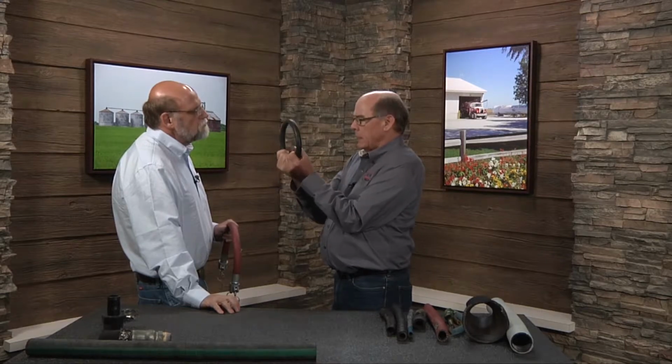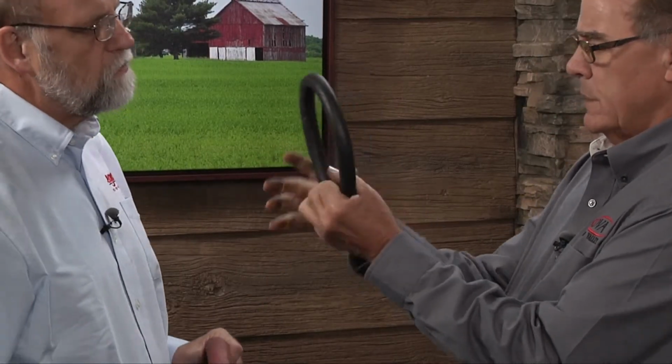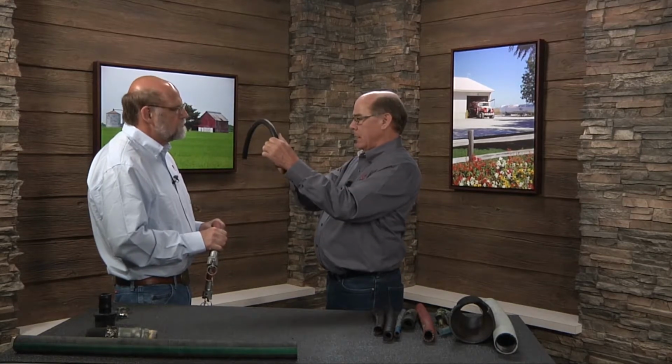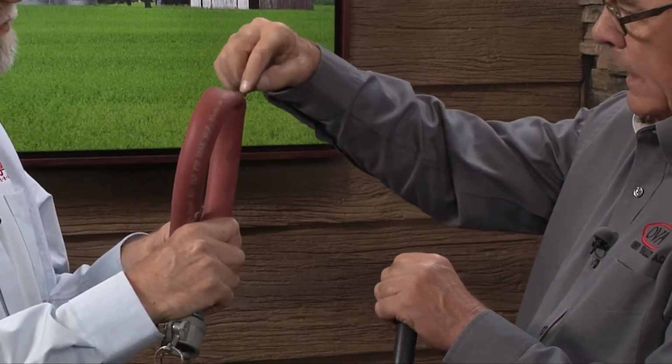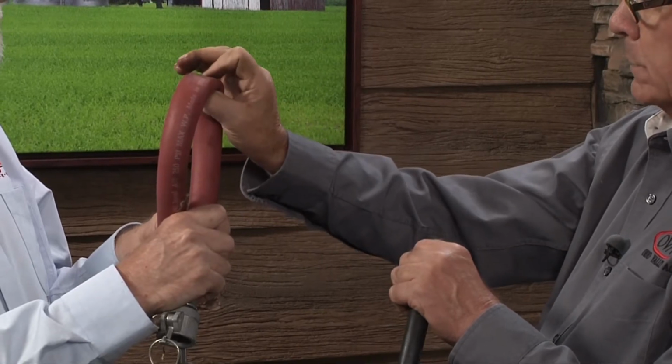It can actually make a tighter radius. And that's what I'm measuring. That's the radius here. This is the radius from here to here. If they tell you that a 2-inch suction hose shouldn't be more than a 2-foot radius, then they're talking about from hose to hose when it makes its turn. Now this is a little bit different on this one. I try to do what you just did, and you could see, you start seeing it actually kink right at this point and shut off the flow of the hose.